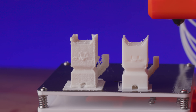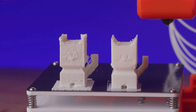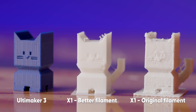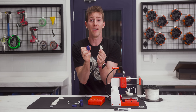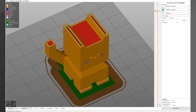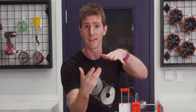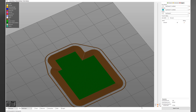The good news is that once we switched to some decent filament, the print quality actually improved dramatically. It's still not great, especially side-by-side against prints coming out of our Ultimaker 3 Plus, but it's in line with our expectations given the price point, and I think we can do even better. From here out, we're going to be making our own G-code using a slicer, which takes our 3D model and slices it into multiple 2D layers that are laid down in order to make the 3D shapes we want.